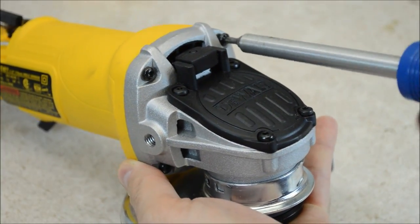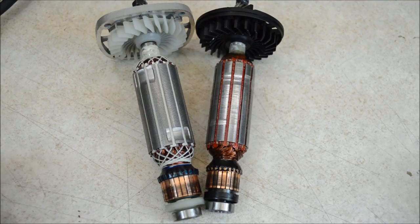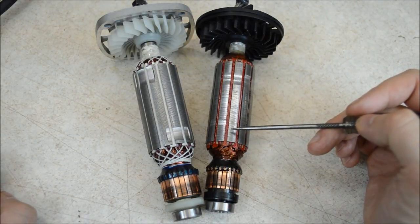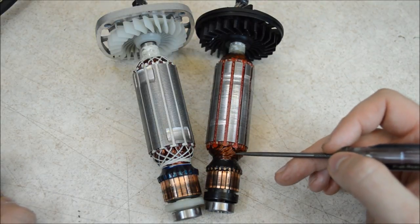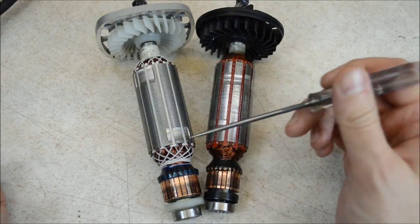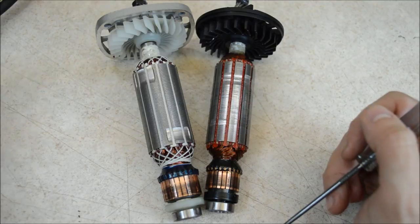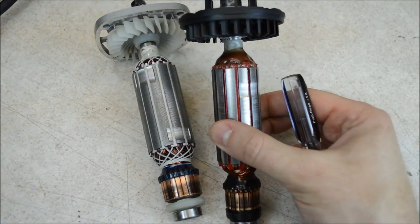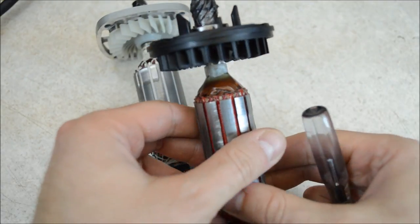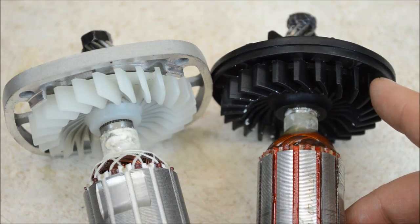Let's crack this open and see what the insides look like. Checking out the rotors, we can see some similarities and some differences. They're both made the same way like pretty much any power tool rotor — stamped laminations that are stacked and then wound. Both of these have been dipped in resin to reinforce the windings and prevent vibrations from breaking something. They also have additional reinforcement — epoxy where the windings connect to the commutator, which reinforces that connection and prevents vibration-caused wire failures. On the DeWalt, something I have not seen before: there's additional resin at the top to reinforce the windings on that end as well.